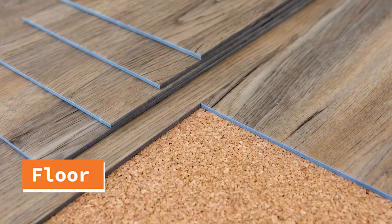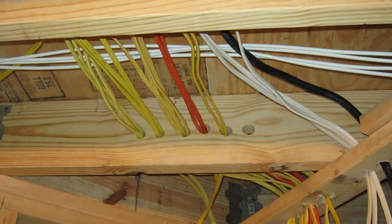Once drywall is done and sanded out, your next phases are your finishes: paint, floor, doors, trim, then your electrical finish, your plumbing finish where they install the toilet, tub, shower, fixtures, vanity — all of that — and then your HVAC finish. After all is said and done, you'll do touch-ups. I've got two little boys that are savages — sticks, balls, superheroes thrown at the wall, wrestling matches — it's all dinged up, so I'm waiting until they move out for touch-ups.